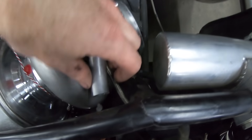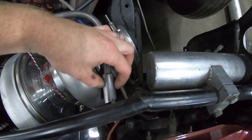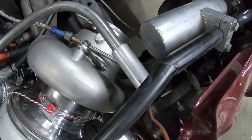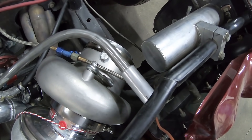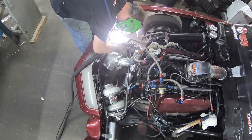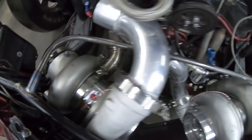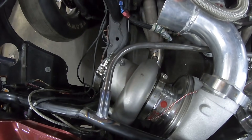I got a couple little pieces here — it ended up being some 7/8 heavy wall. It slips over this 5/8 real nice and it's snug so it doesn't wobble around. It's going to get welded to this upper support like that, then we'll drill a hole so a bolt goes through it, so that 5/8 tube will still be removable and only that little 7/8 snub will be left. Paint removed, clean and ready for welding. That'll sit back nice and tight. Next I'll drill holes through here, drop some bolts in there, that'll keep it where it's at, then we'll send some stubs down to the turbos.